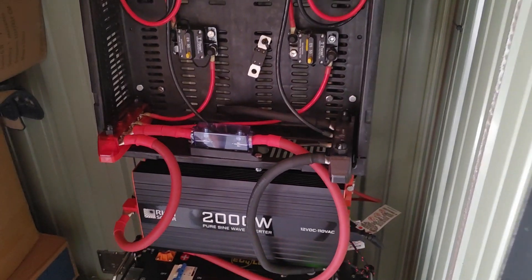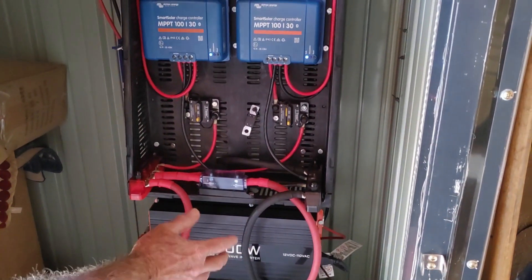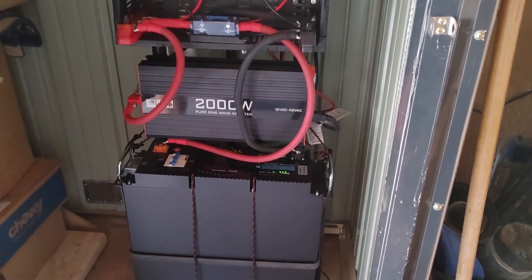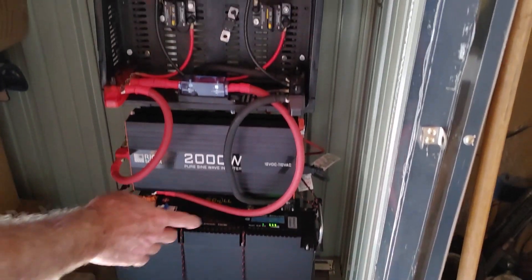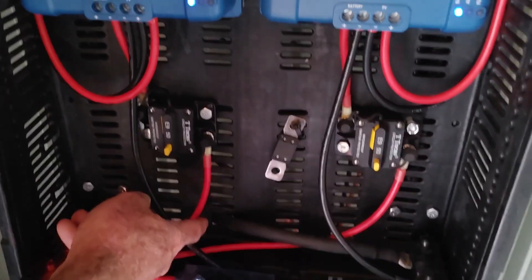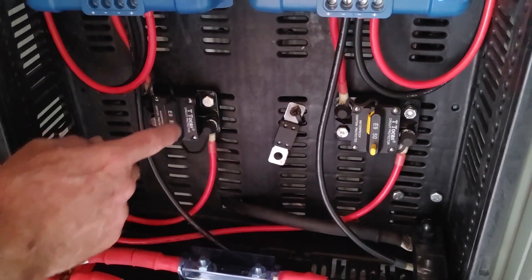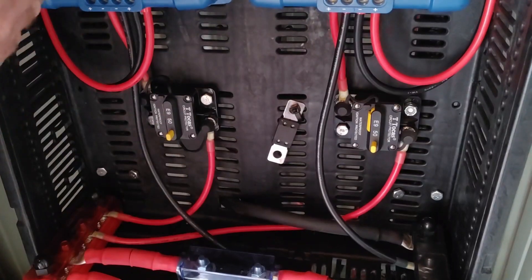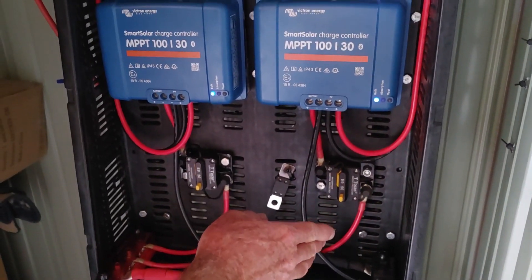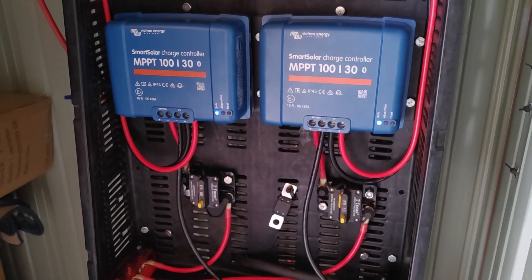I was watching a guy and he did run it up to 300 amps and I really don't want to do that — the wire is okay for 250 amps basically. And then what I've got here is I've got a 10 gauge wire running from these 50 amp breakers. That way I can shut each individual charge controller off and turn it on. I wanted to do two of these because I wanted to have two solar arrays.